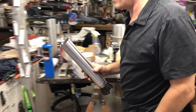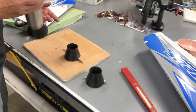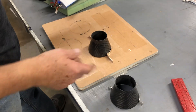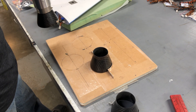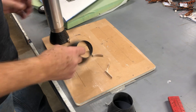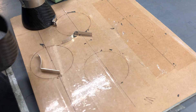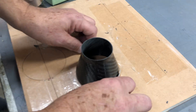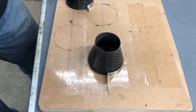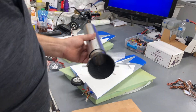Let's talk about the pipe before I put it in. I don't want to sound like a broken record, but I've mounted these tabs on all my other video series before — I'm not going to do it again. I'll insert a link exactly where to find it. It's pretty simple: you just draw a circle, draw a line right through the middle, hot glue that down, bond these on with J.B. Weld, then stick in four rivets. All the other videos call it out in detail, so we're not going to do that.